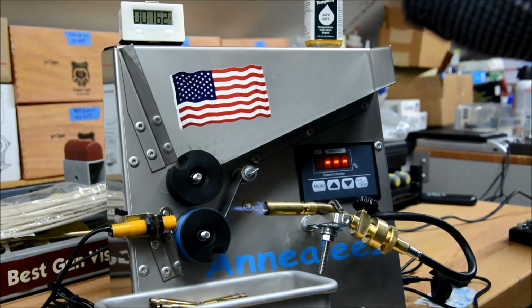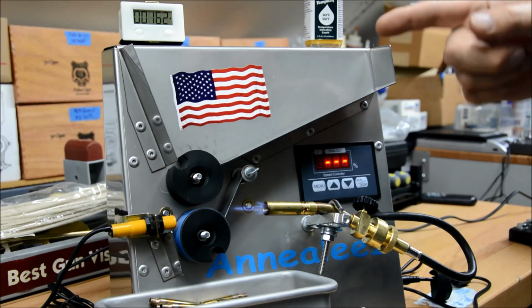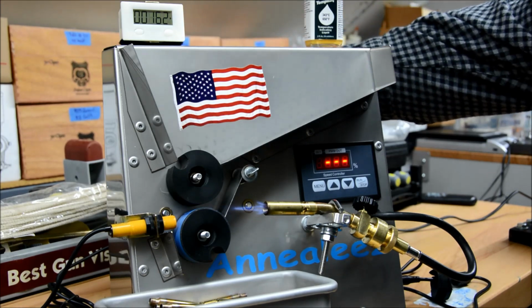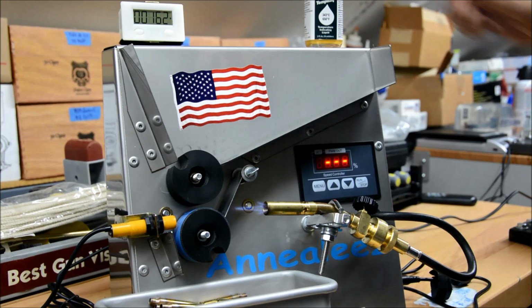All right, we'll shut off our gas. Just to mention, this is my own safety tip. If you think it's wrong, please go ahead and mention it as well. I always like to shut off the bottle first, and that way we'll burn out what is mainly in the hose, and it should be safer to keep that propane from staying in the hose that way.